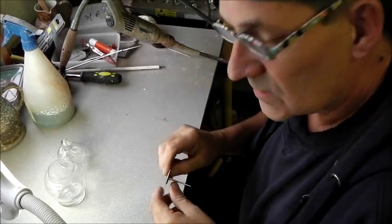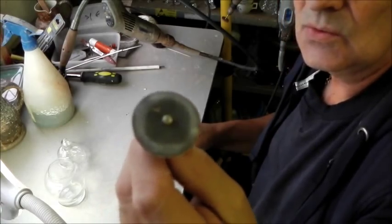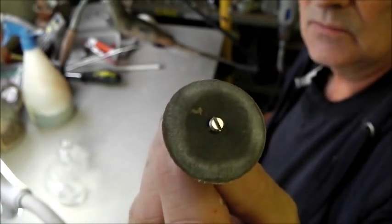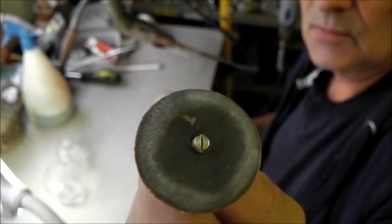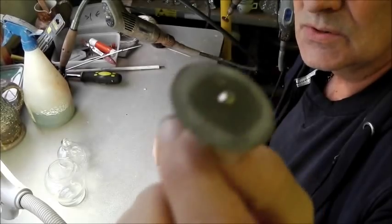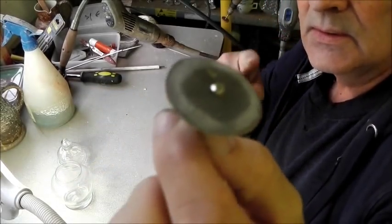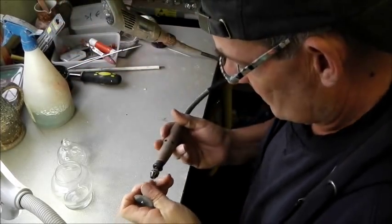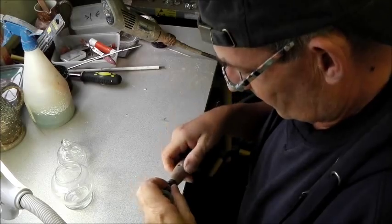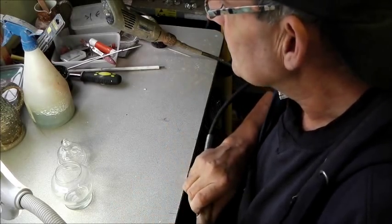For the purposes of this I'm going to use the 600 grit. I'm going to use a nice worn one — and look at that, you can see the cloth coming through from the back. You think that's finished but it's not — it's ideal for this. It's a very thin glass, we don't want to attack it hard, so a nice worn one will do the job. You'll be surprised at how much can be taken off with a worn piece — it's abrasive.